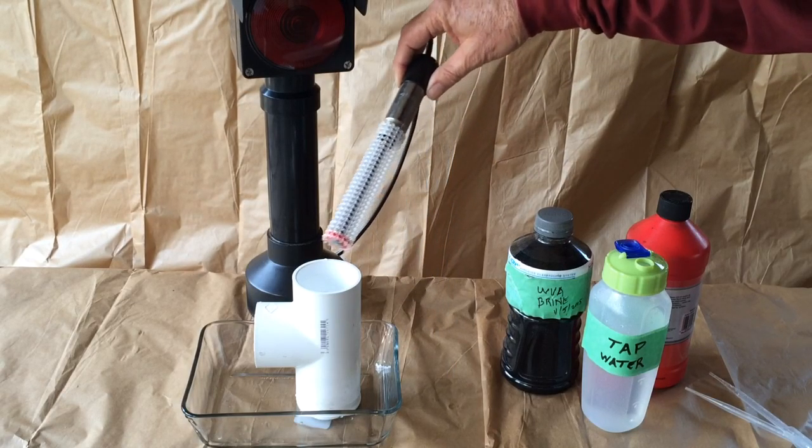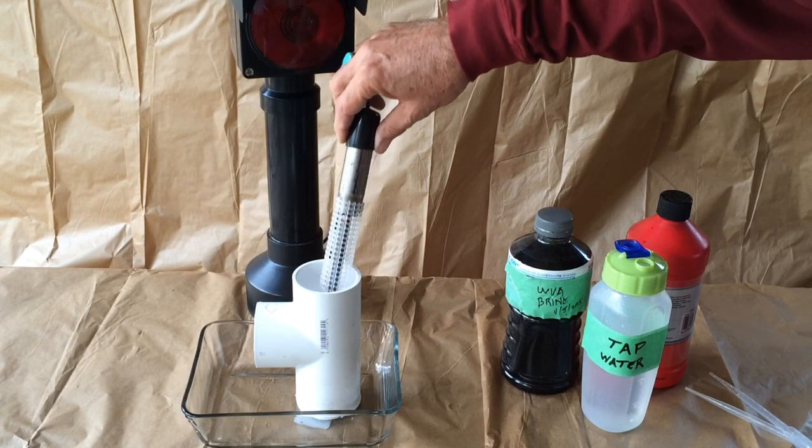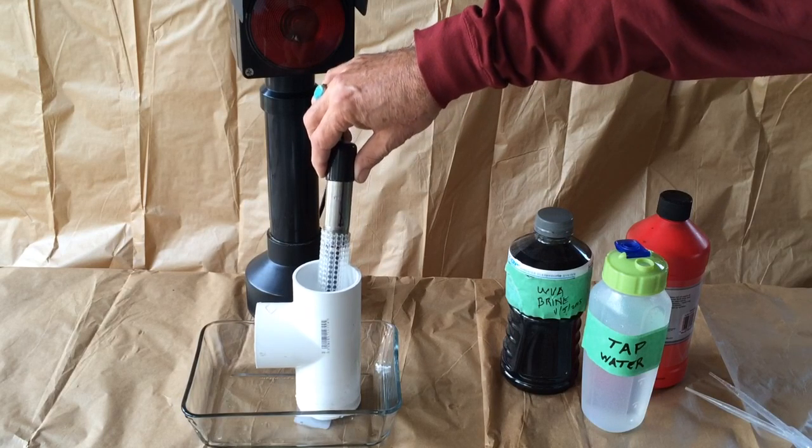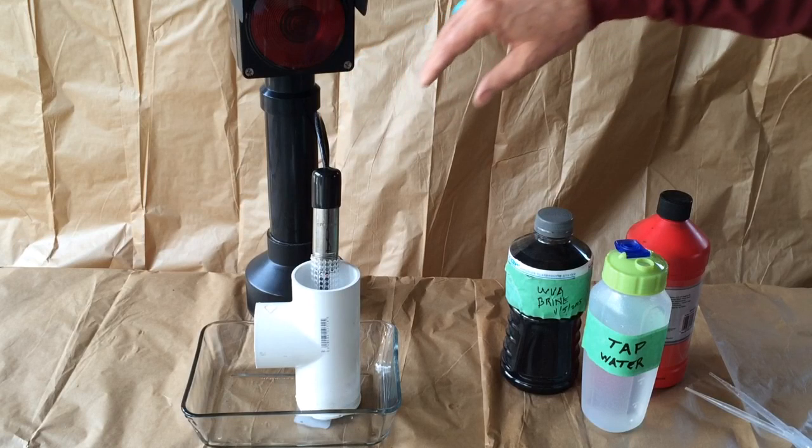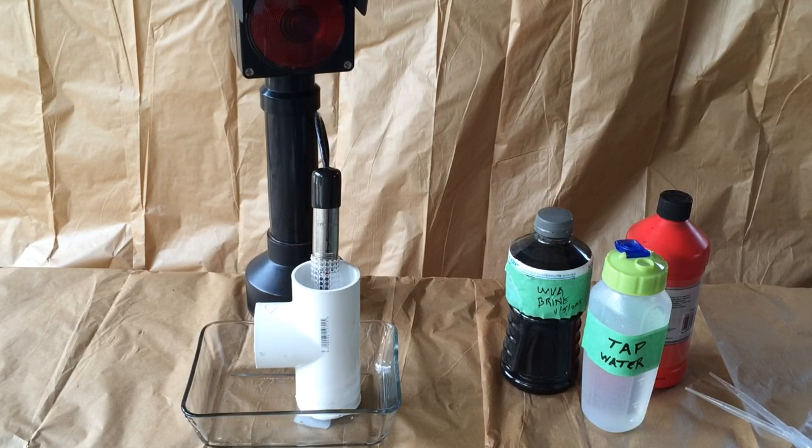We're going to place it in a PVC T-fitting that's capped off at the bottom. And typically this would be in a collection sump or a low point. In the case of underground storage tanks or above ground storage tanks, you might drain into this little T-fitting with a slotted PVC conduit. The indicator is this flashing LED device called the Flasher BE.